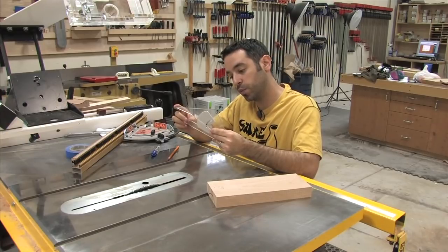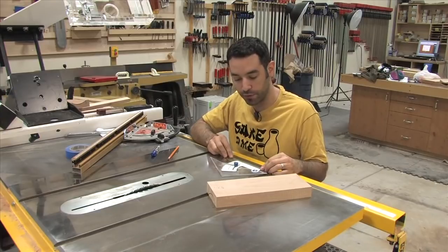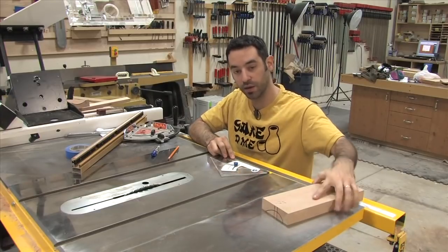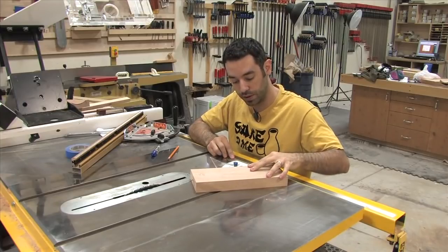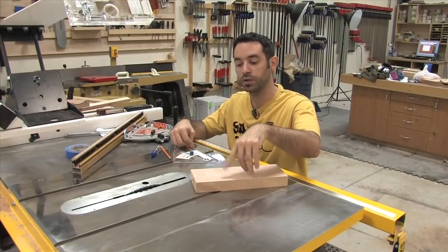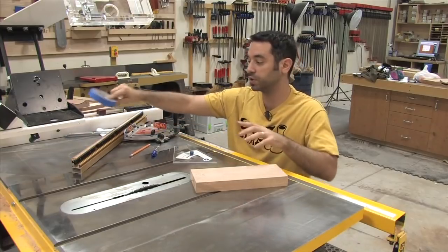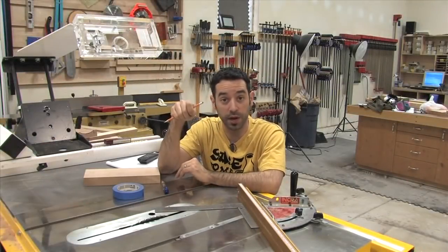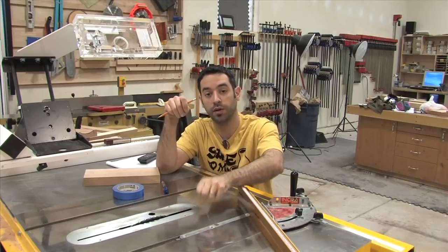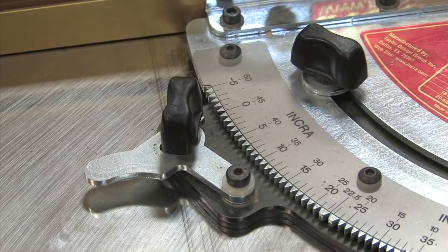At this point, using a pencil I could draw on the table, or use blue tape to mark positions and drop my parallelogram jig right on top. Another method involves using your miter gauge and a very simple square. The program told us 61 degrees — subtract that from 90 and that gives us 29. Make sure your blade is at the maximum height of the apex, three quarters of an inch high. Take your square, put it up against the miter gauge, and bring it forward, looking for the point where the blade just contacts the square, then back it off just a hair.